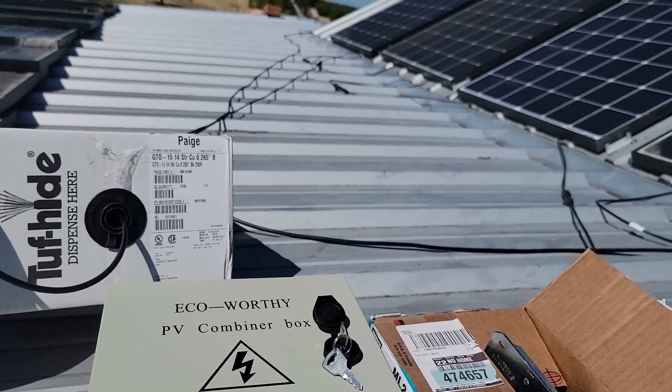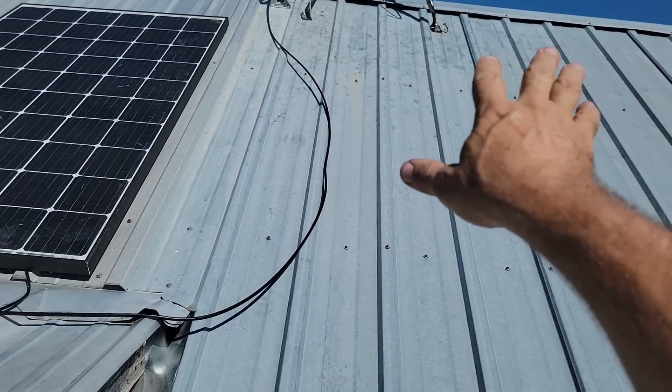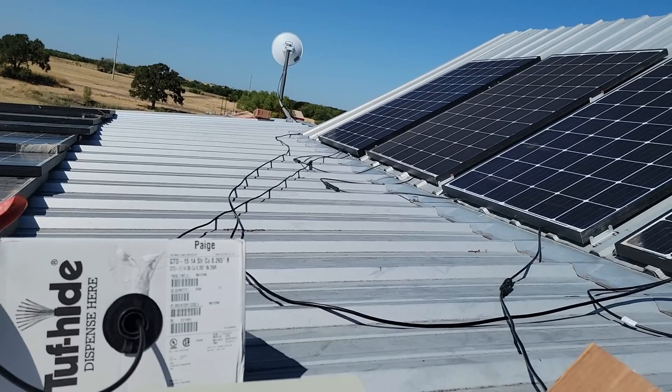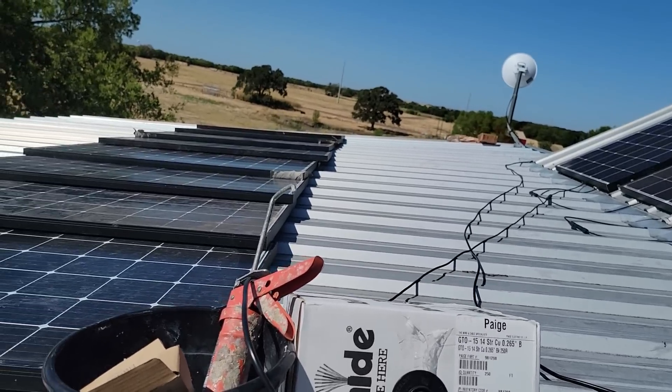It's going to get really hot on me, so my goal this morning is to get two more panels up, which will give me six. I'll have everything here, and maybe late in the evening I can get another set of three tied up. Over the next couple of days I'll try to have all of them in place — it is mega hot up here. Three more are now connected and putting out power. That's now six panels going — two strings in series.